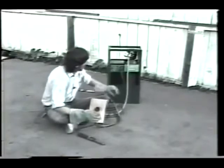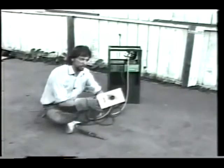Whoa, this is an exothermic torch, very versatile device, contains pure oxygen, regulator, hose, 12-volt rechargeable ignition system, comes out to this hand grip that controls the oxygen. I press the grip, I get oxygen. This is steel, hollow inside, covered with copper, but it's steel. What this does, when we rub it, and turn the oxygen on, which I'm not doing right now, we get ignition, very easy to light, lights the torch, the burning oxygen flowing makes the steel burn.